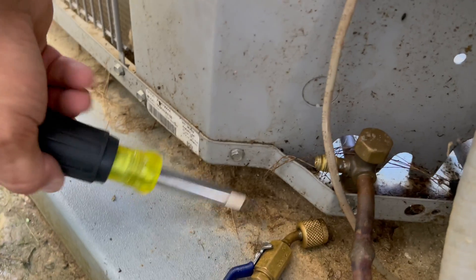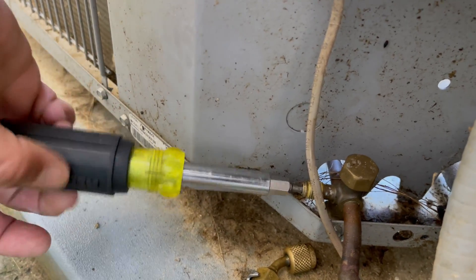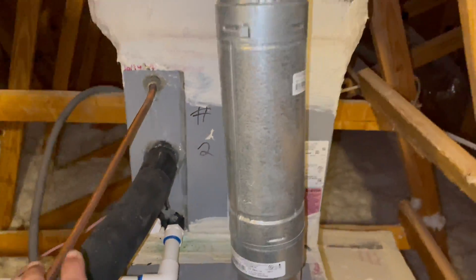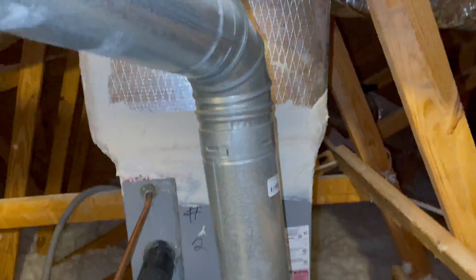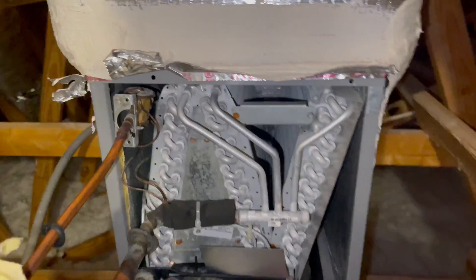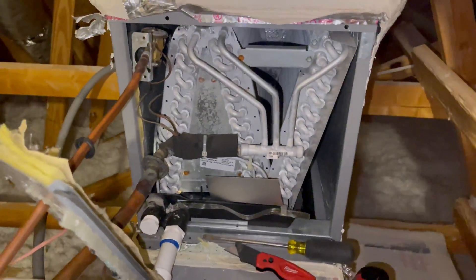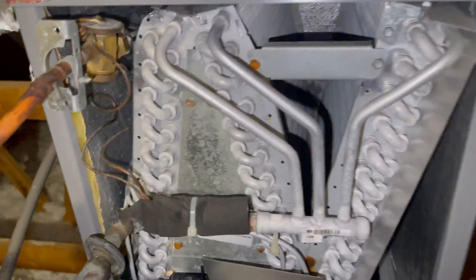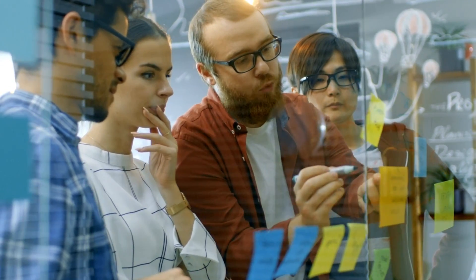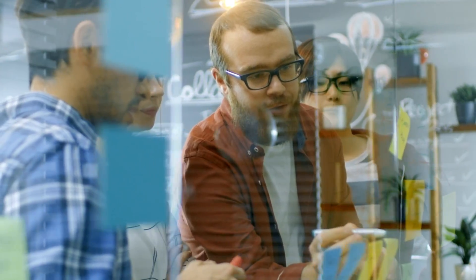Before we get started upstairs with the TXV, I'm going to remove our Schrader on our liquid line. So this is our coil. We're going to have to remove some of this B vent and get it out of the way, and then we'll get these doors taken off. So I had to get both doors off, got the double wall B vent out of the way. I swear it's like Carrier has a team that sits together and says, 'What is the most difficult way we can make this on someone having to replace a part for us?' And they come up with these ideas.